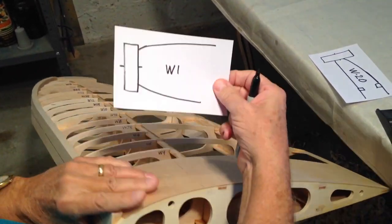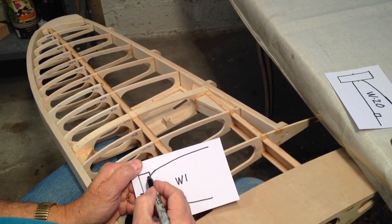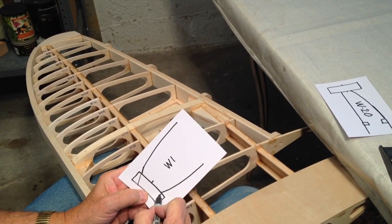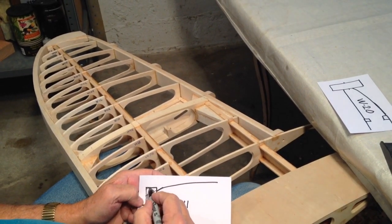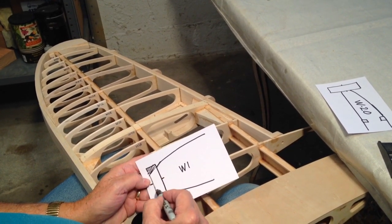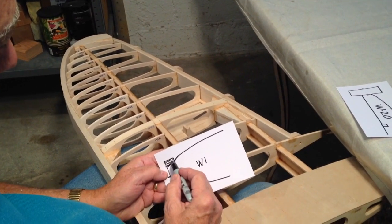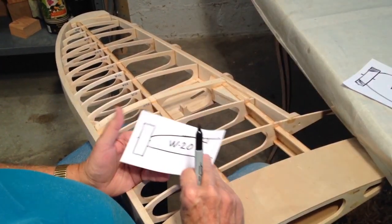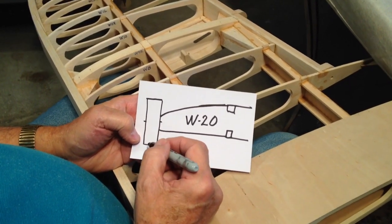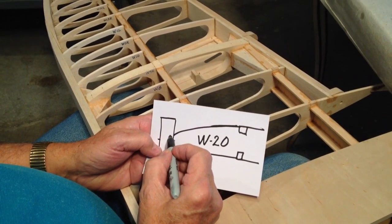What we're going to do is attempt to shape this with a plane. We're going to pick up the angle here and come across straight — not all the way down — and then just plane all of this off. We're not going to try to curve anything, just come straight and pick up the angle of the airfoil. When we get to W20, you can see it's tapering a lot whereas the leading edge stock hasn't tapered at all — it's still two inches. So we're going to have to plane off quite a bit more and the angle will be steeper.